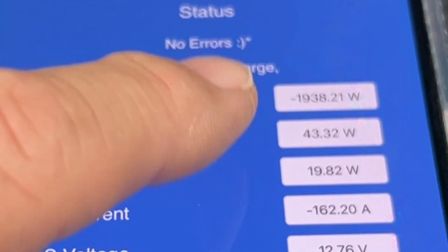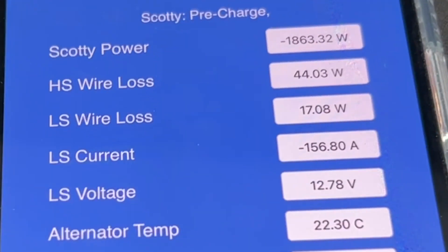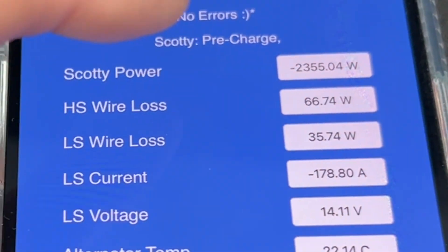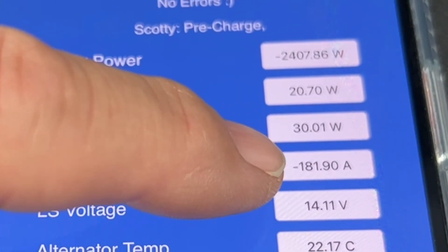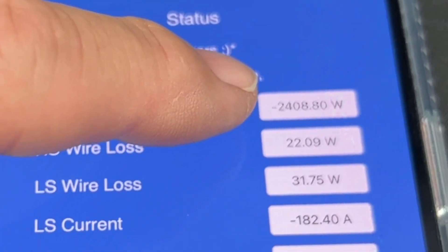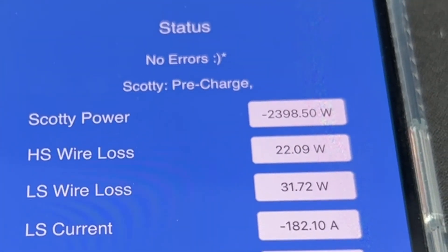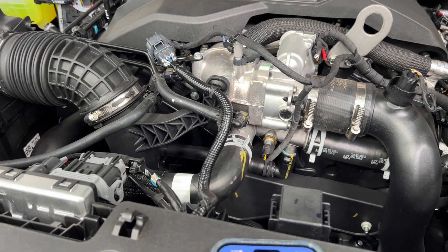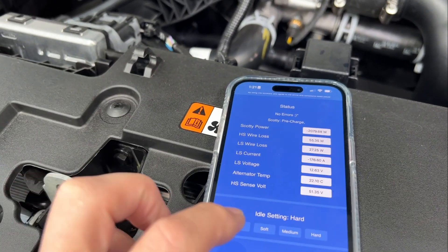These are our losses on the battery wires — very low. So we've just got it sitting here. Kevin's now going to take the revs up and see what we get out of it. Looks like the maximum we're getting is about 182 watts, just on 2400 at the top there. That's the maximum we're getting out of the alternator. That's a good result. Thank you Kevin.